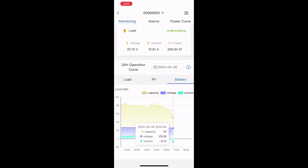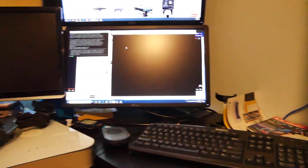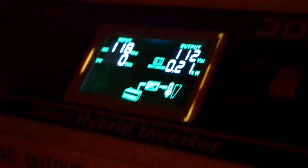That battery doesn't have enough juice to keep everything powered overnight. The beauty of this EcoWorthy system is that when the battery runs out, it plugs into the wall and switches over to house power — and it does it without any blip; my computer doesn't even notice. Then it switches right back to solar power in the morning when solar comes in. Although it didn't work for our initial uses, it's ended up being very useful. I'm now saving probably $100 to $150 a year, and the solar readout is showing 0.21, meaning about 200 watt-hours.